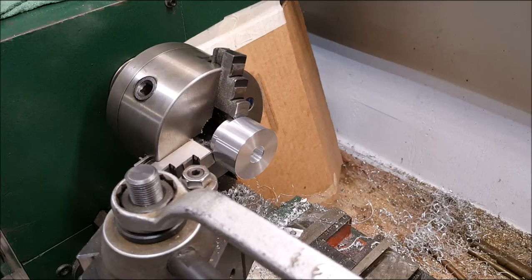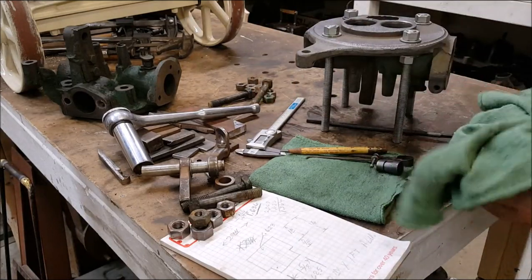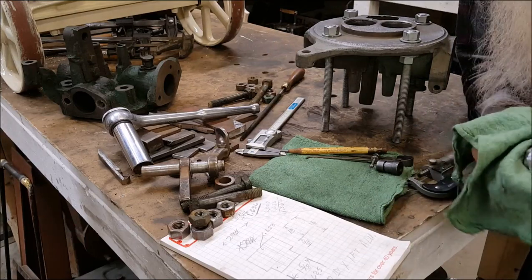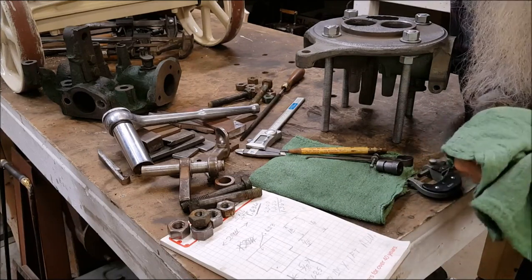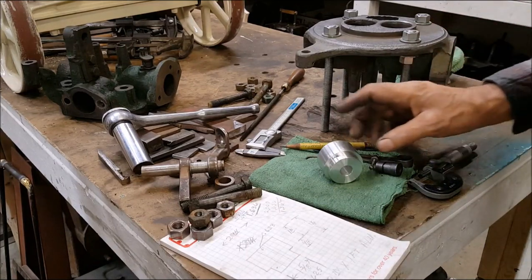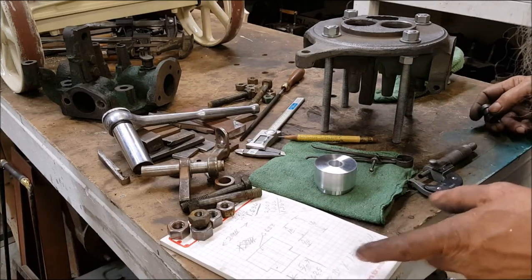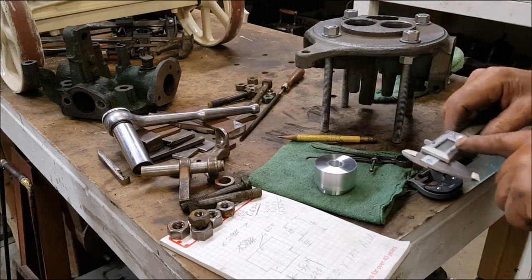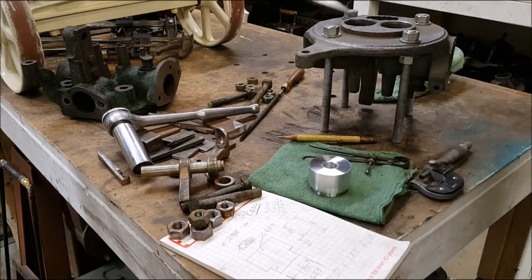Well, let's put it on the workbench over there and see what we've got. All it is is a reamer guide for valve guides — replacing valve guides. It's kind of about as good as I can do. Just a hunk of aluminum, started out two inches. This is the size right here. Let's see what that ended up being — that's 1.988 is the outside diameter on there.